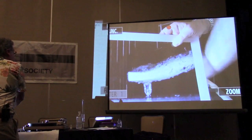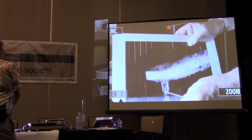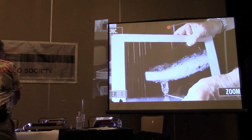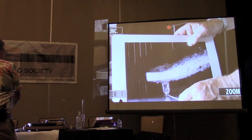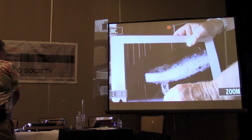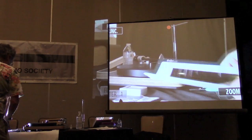Now this is a line contact type stylus. You see that line? That's the line that contacts the groove wall. That line should be 2 degrees beyond perpendicularity to the record surface. So notice if that was perpendicular, it should be over 2 degrees. So why is that the magic setting?